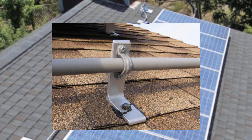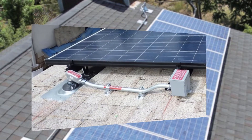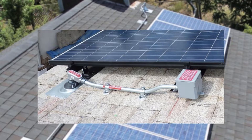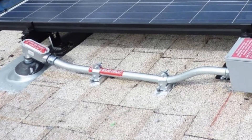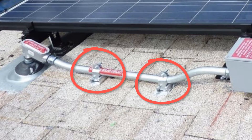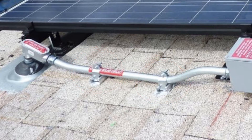I just wanted to share it with you because it's out there. Here's a different example. At first glance you might think this is a little more pro — they've got good labeling on there, they've got some good conduit bands, maybe these guys are okay. But no, they've used a technique for mounting conduit that should be applied indoors against a wall. They just cut a couple pieces of c-channel and bolted them flat down onto the comp again with a bunch of goop. I don't know what it is about some people — they think that if you squirt enough sealant into something that you've made a good mount.